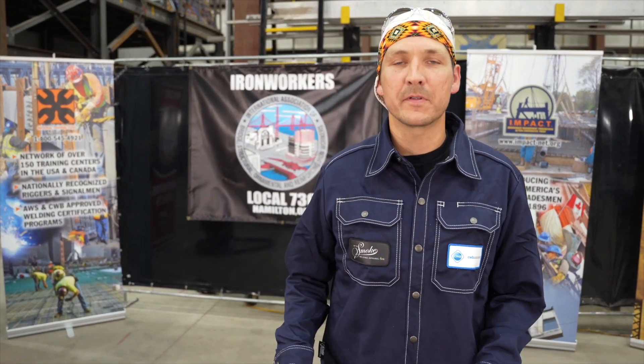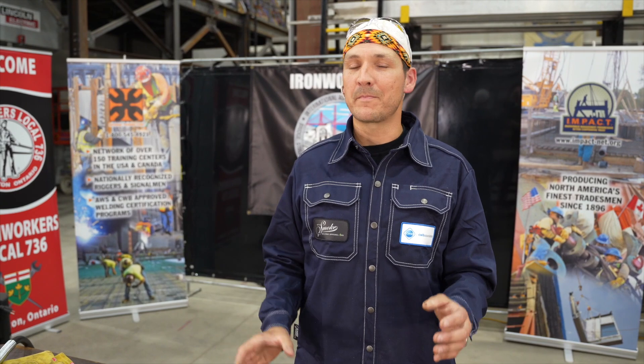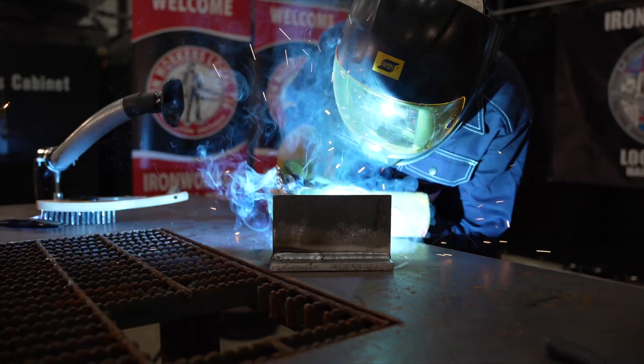We've gone through the reasons why people have failed to make tests and did a demonstration. It's important to understand that MIG welding may not be as easy as we think — it may be easy to get started, but pay attention to those voltage settings and don't go too far outside of that setting. Watch your travel speed, your angle, and your wire feed speed.